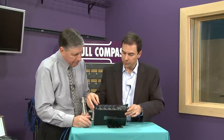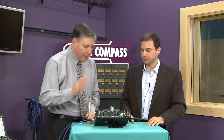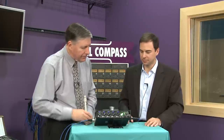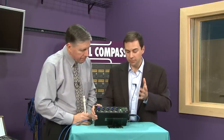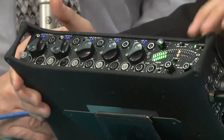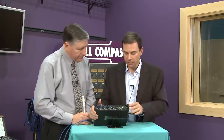When you're out in the field, the three most important elements are going to be monitoring — listening in headphones — metering, and level control. We've got nice full-size level controls with big faders, and an incredibly informative meter. We're seeing both peak information and VU information simultaneously, so we can see compression happening as the peak and VU levels vary between the two. There's lots of information on the meter.